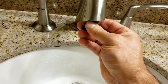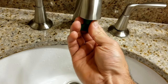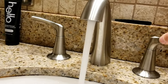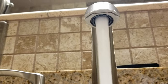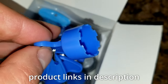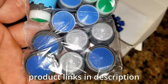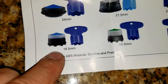If your problem is not one where you don't have a good steady stream and you want to save water, you can actually replace your aerator with one that restricts the flow. Once the aerator is installed and I turn on the faucet, it's a nice steady stream again. I went from 1.2 to 1.5 gallons per minute so there's a little bit more water. In the description I have a link for this universal kit that has all these tools for different faucets and different aerators — it's a good kit to have if you have different faucets. There are different sizes and different gallons per minute options.